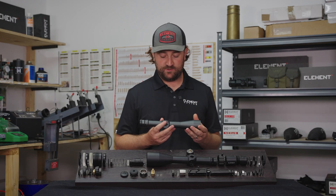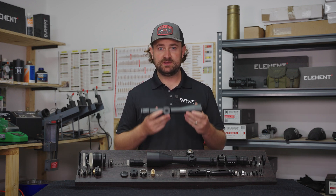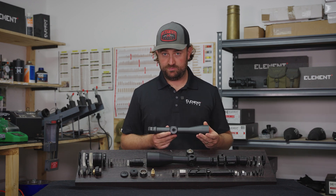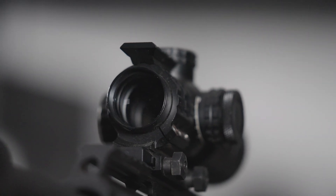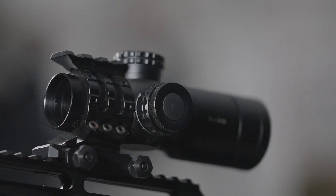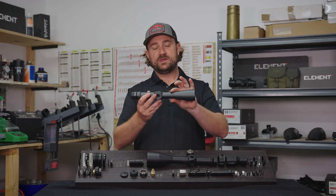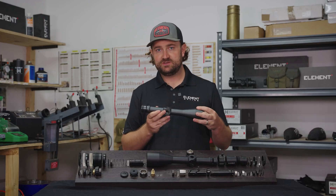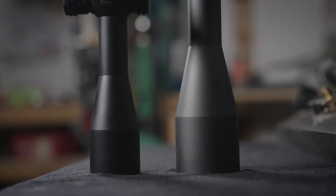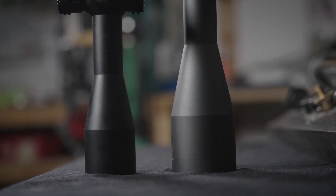The goal for almost all manufacturers is to keep this part as light as possible without sacrificing the structural integrity required for the specific use case of that scope. Some body tubes have a straight profile in front, as is the case with most LPVOs, but generally speaking we need a larger objective lens to gather more light, especially with high magnification rifle scopes, so it's normal to find the objective lens flaring out to form what we call an objective bell.